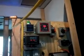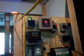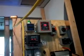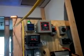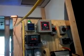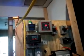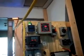The amps are going to continue to climb as the supercapacitors are completely discharged. Basically, the battery bank has to compensate by giving more power to the supercapacitors to provide power. The iron's at full heat, and I just heard the thermal switch turn itself off. Now we're instantly back to charging. Awesome. That took about a minute to heat up completely, and as you can see, it was pulling somewhere around 80 amps. It's going to continue to cycle to keep the heat up. But that is crazy, 80 amps on a 12 volt line.